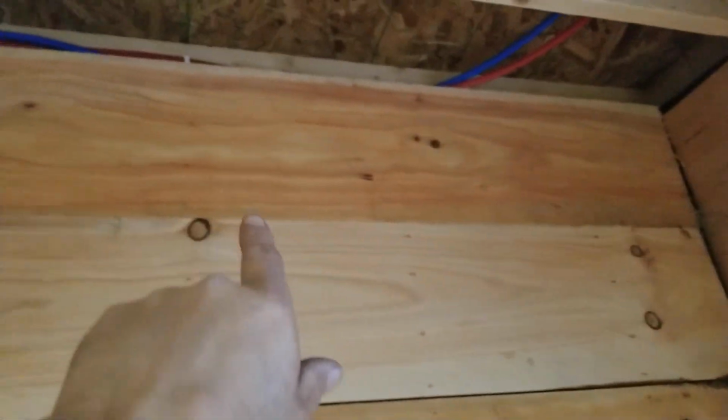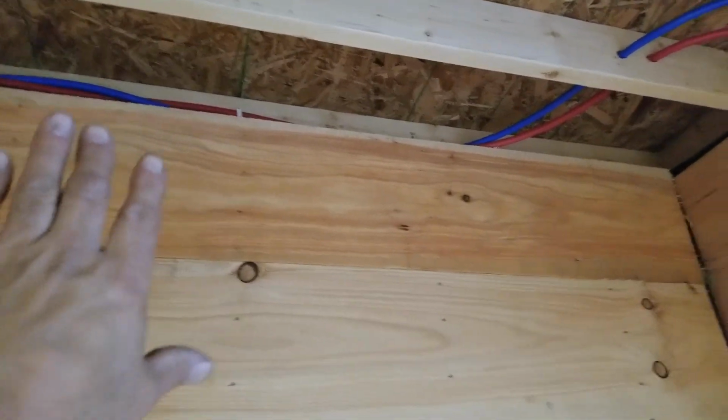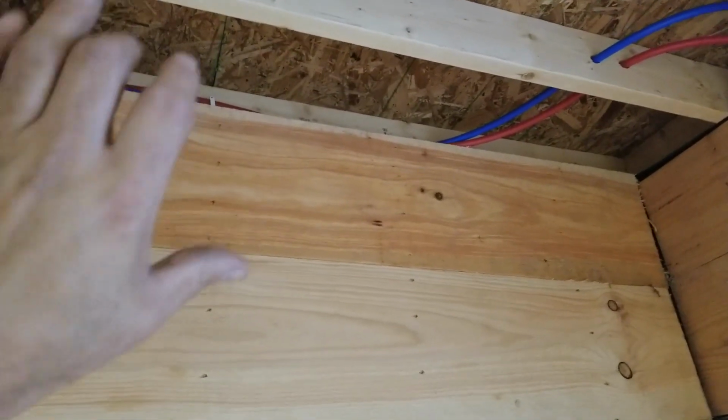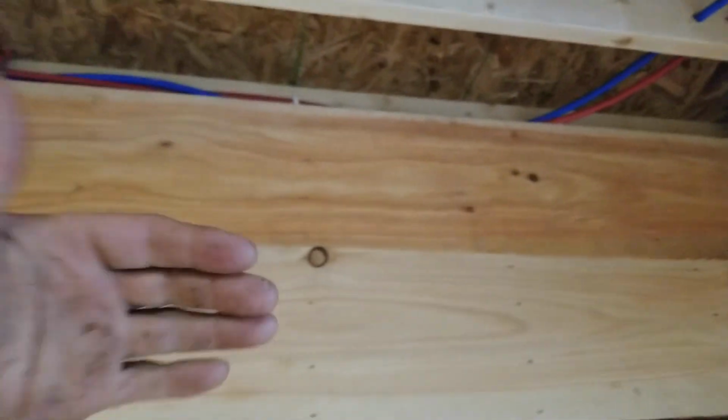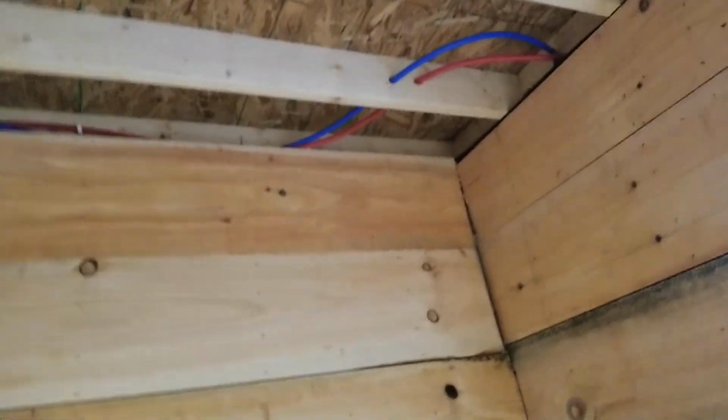On the last part, I put the paper up and kind of stuffed the stuff in there and then folded up with it on there. You should be able to see it in the time lapse of this one. Because if I try to fill it up and then turn it loose, it just falls out. So I pack it in on the back of the paper and then roll the paper up into the wall and staple it. And that way it packs it all in. Over here, of course, there's no insulation because it's the inside wall. It's just wood on the inside here. Didn't bother putting the tar paper up and all that. It's just the wood.